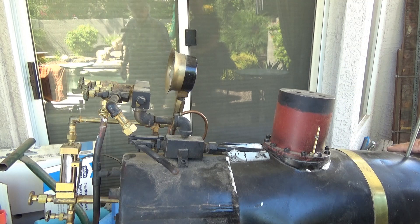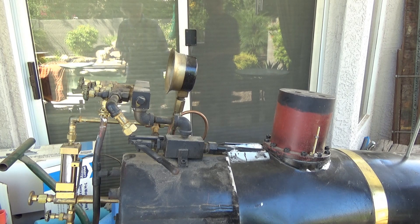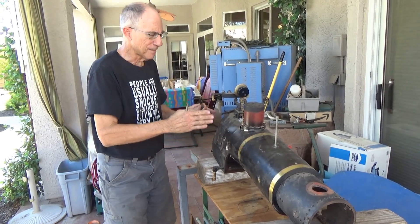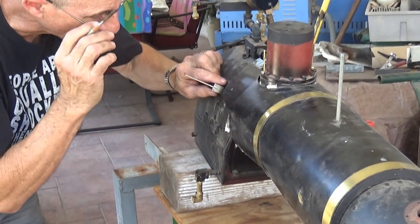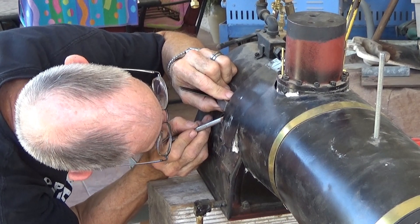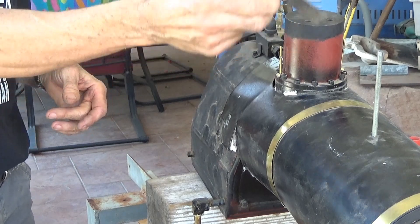That's great for us because we get to see the process in many of the components of the locomotive without years of building time. We're only talking months instead of years because we're rebuilding this. So this is going to be fun for the viewers that are watching, I'm sure. All right. So the first thing we're going to do is mark the rear edge of this wrapper. The cab sits right here, and obviously I don't want this to be longer or shorter than where the cab position is. So I need to mark where this is going to go, and that gives me an idea of where I need to have this template sitting when I wrap and start providing the template cutout holes for all the various openings.